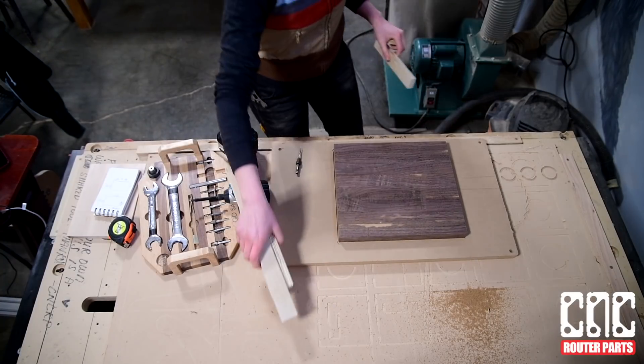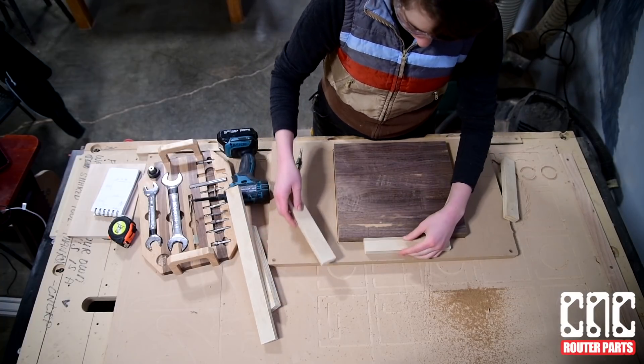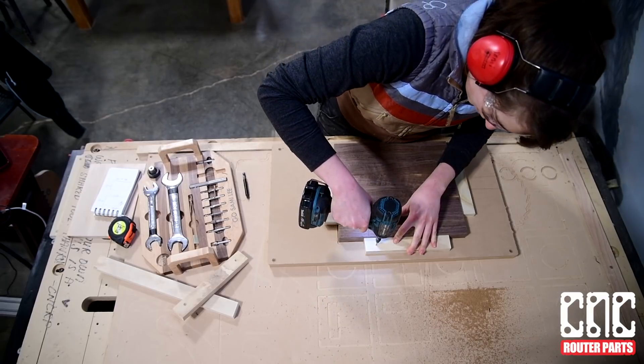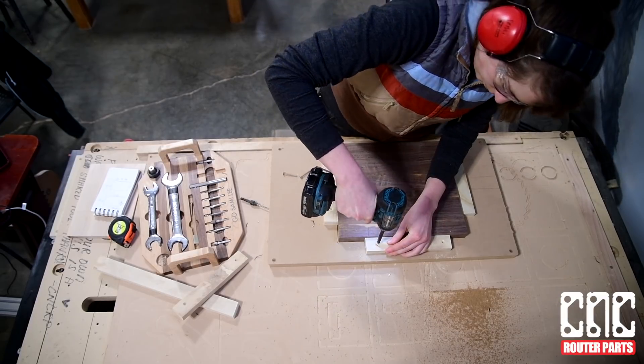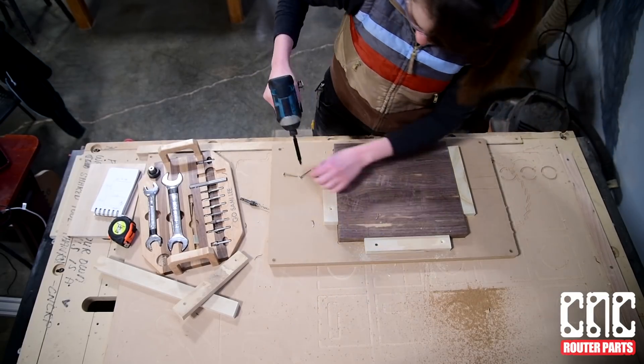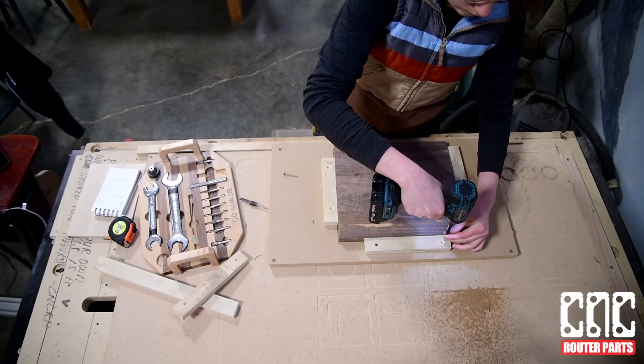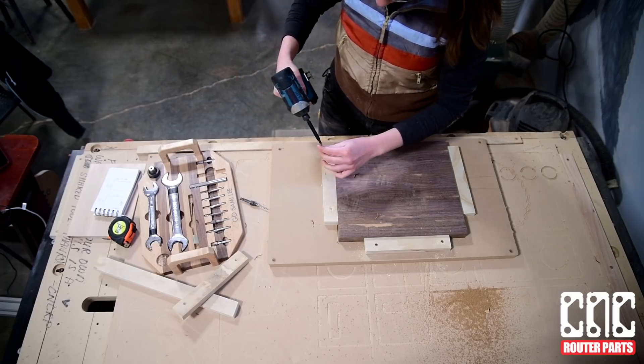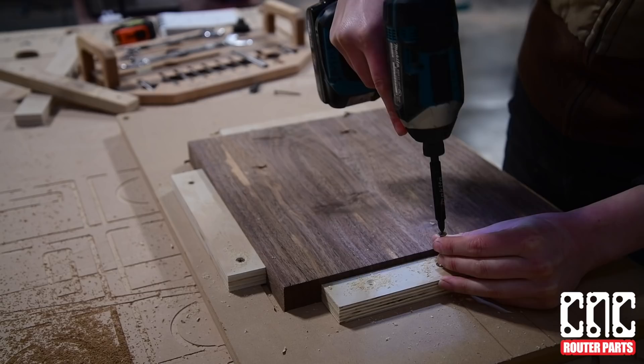After this, I'll install a few strips of scrap wood to create a pressure-fit jig around the material. In most cases, this would be enough to hold the material and run the program, but we'll have it hold the material in place while we run our pilot holes. This works really well because our V-bit puts a light downward pressure and doesn't pull up on the piece like an up-cut or down-cut might.